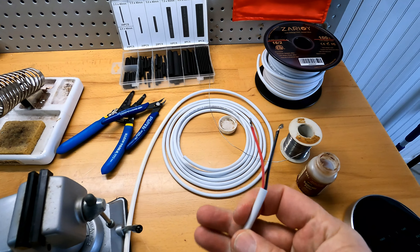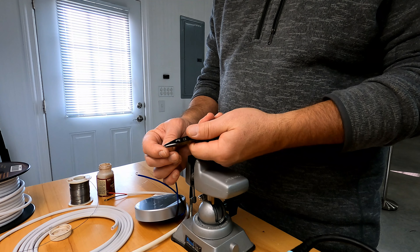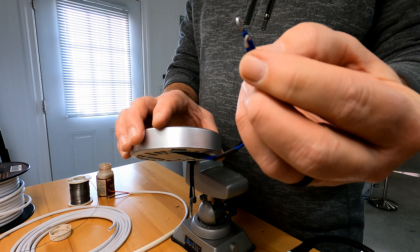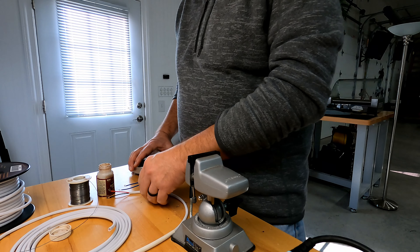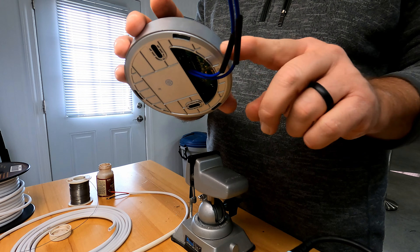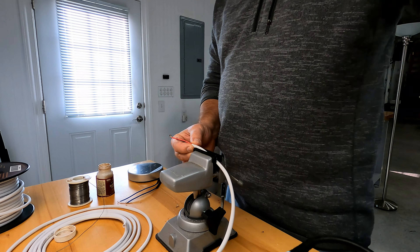Next step is preparing to install the hot water heater control unit. There are two blue wires — no polarity, you can connect however you want back to the hot water heater. They don't give you the wire, so I'm using jacketed PVC 16-2 wire, rated for low voltage power or speaker wire. Someone was saying you have to use blue wire — no, it doesn't matter what color the wire is. The jacket protects it going through the walls of an RV, and that's why I'm using it.